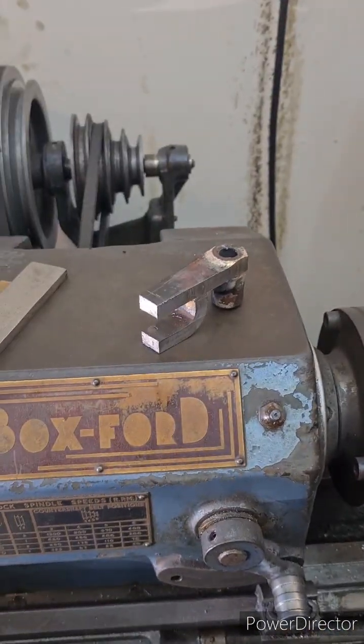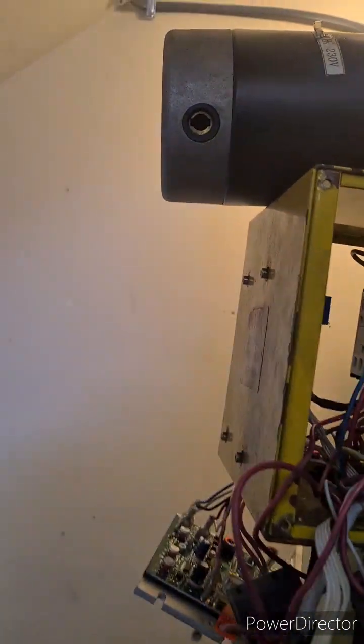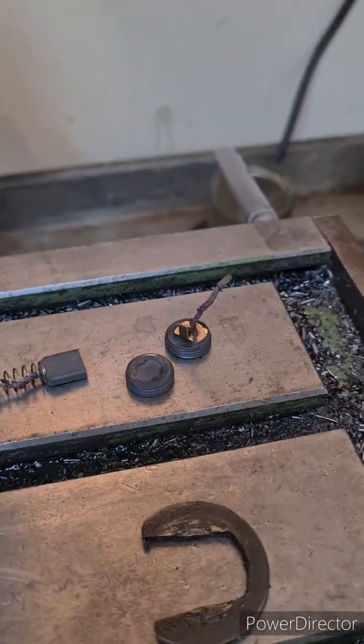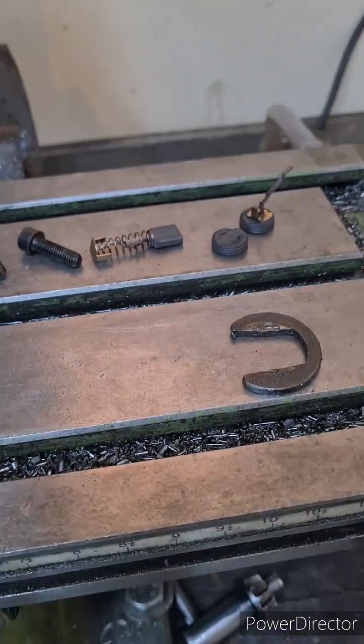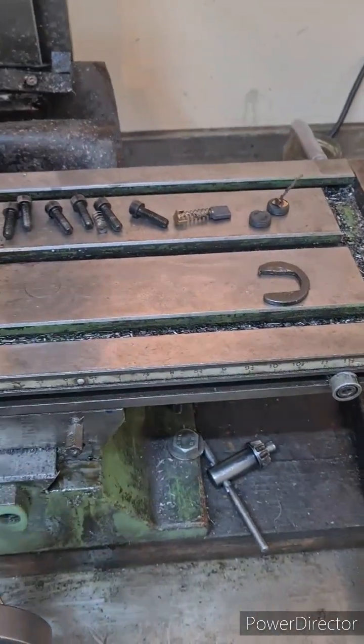So what's wrong with this picture? Well, turns out the brushes on the mill are gone, that's all that was driving it. I couldn't believe it was actually still going. I've got a couple of replacement brushes coming, and also got a little speed sensor replacement coming as well. So while we're waiting for that...